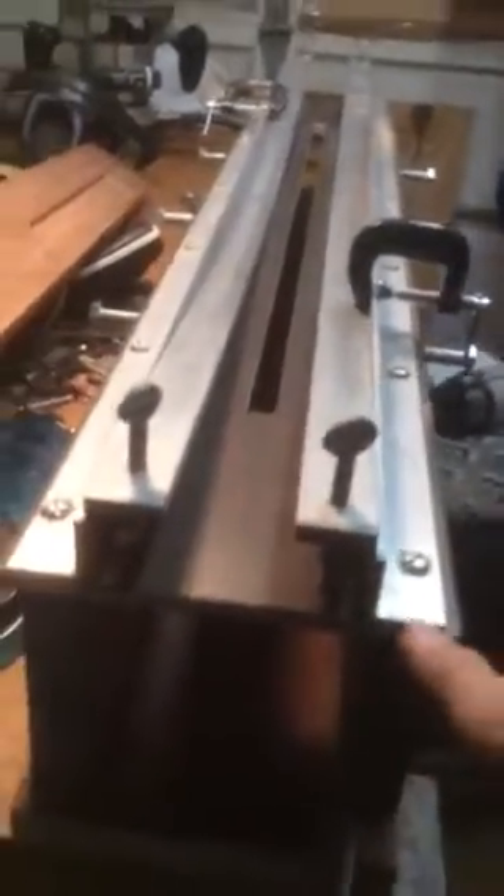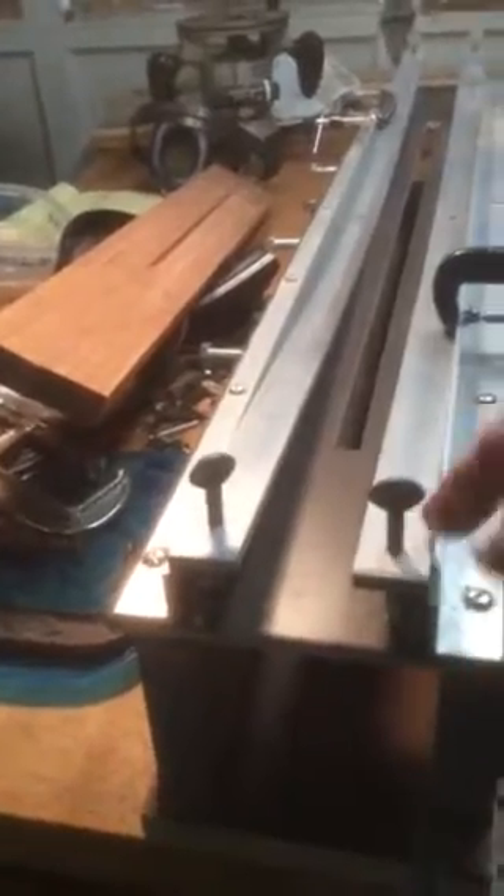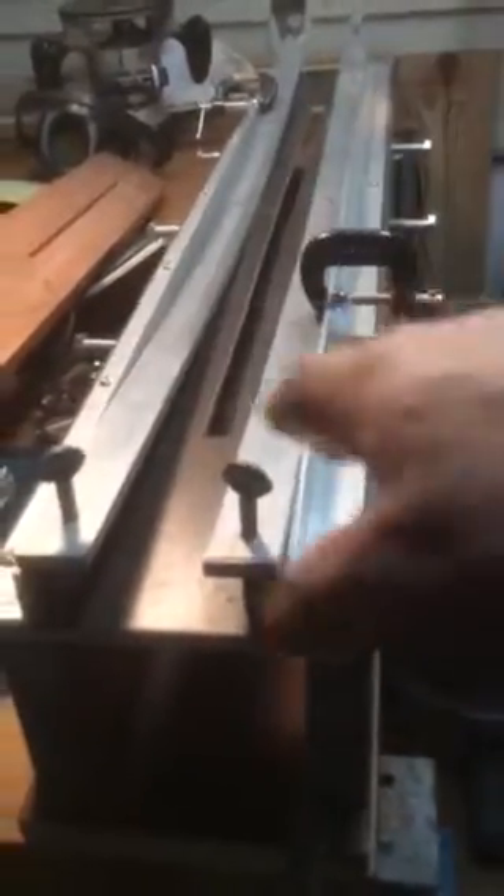Getting back to the aluminum on the top of it here. Put your side pieces like this. Then get some thick quarter-inch bar stock — you can get all this stuff at just about any hardware store. Put your bar stock on here, drill a couple of holes in the end, thread them, and put some — I don't know what you call those things, they aren't wing nuts — in there. That way you can raise it up and adjust any way you want to, the height here and on the other end.